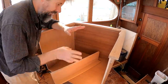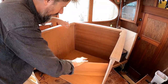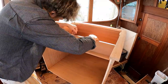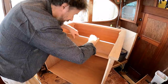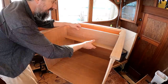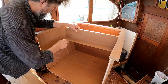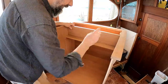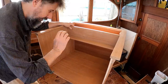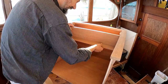Okay, this next bit is really a fiddle. It's a glue up, right? But the pieces I have to put in are a basically tight fit between the two sides. Where does this one go? It goes way up here. So how do we glue that in? Well, the trick is to lower it in back just a little bit and glue down the edges, and then you walk it in over the glue. That's another reason the PL is really good. It's not gonna drip down all over the place, and because it's really thick, it just rolls in underneath and does a pretty good job of this. But still,